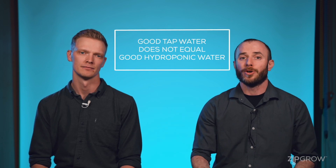How important is it to use a reverse osmosis system in a commercial farm? On a commercial setting, it is absolutely vital. We run into problems where people believe their city or tap water is adequate enough for a farm. While it might be safe for humans to drink and safe to water plants with, when you're dealing with commercial operations it's really hard to dial in the adequate nutrient amount. City or tap water is not always stable, so when you're adding nutrients to it you'll get pH swings that negatively impact your crop. Given the price point of an RO system — under $1,000 a year in filters and membranes — it is quite an insignificant cost, and there are very serious implications if you're not replacing them routinely.